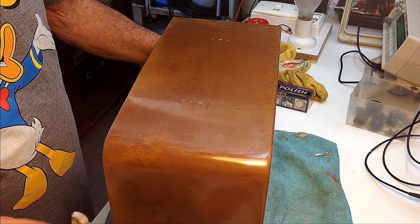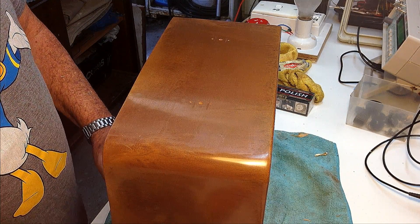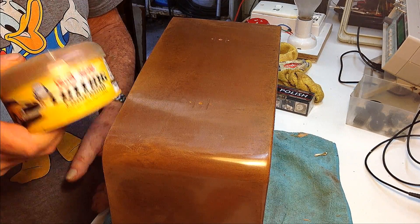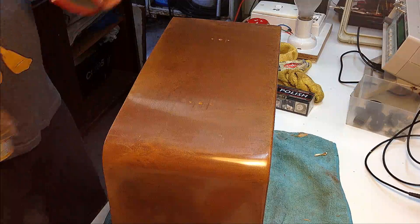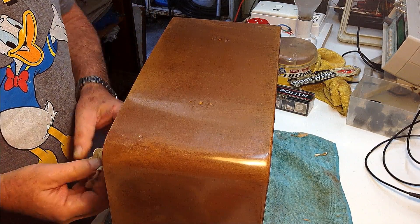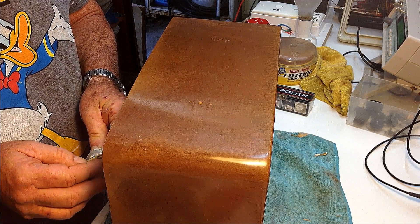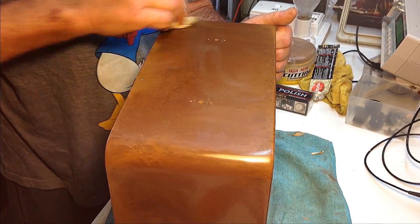I'm polishing the cabinet with metal polish now - this stuff you get from car shops. I initially gave it a rub back with cutting compound and that brought it up okay. I then tried the next level of cutting compound, a softer cut from the same manufacturer, but it didn't make much difference. So then I thought metal polish might work better. I reasoned that Bakelite is harder than paint and these things are designed to polish paint. The metal polish seems to give quite a nice finish. I've done most of the cabinet, leaving the top for last - you learn from your mistakes on the other sides, then don't repeat them on the top, which is the most visible.